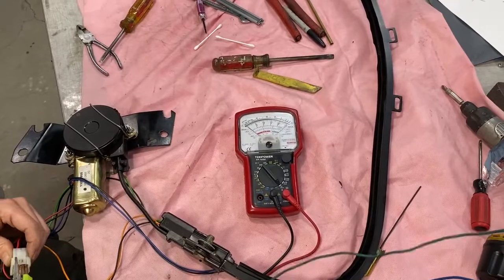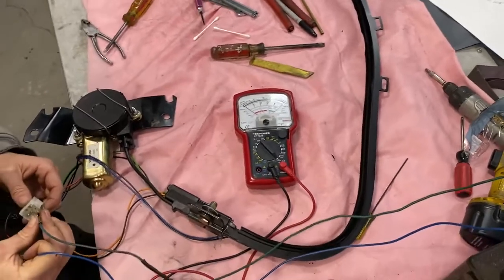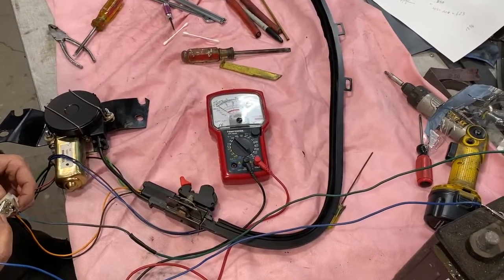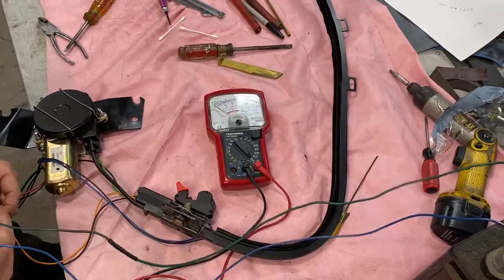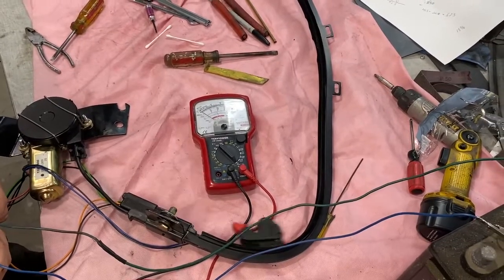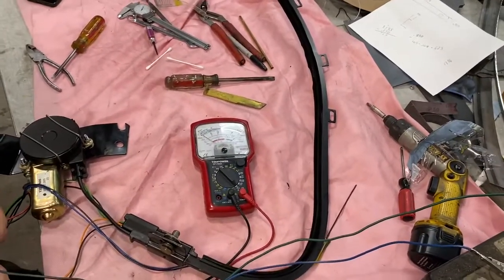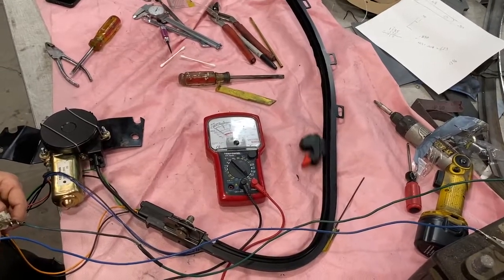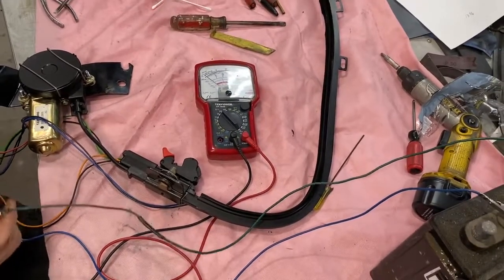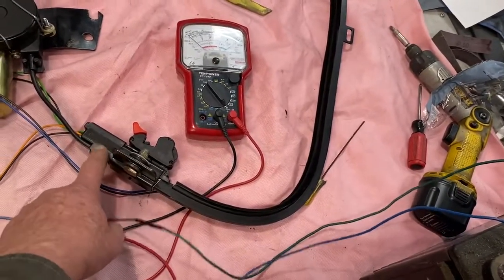Now we're going to bring the trolley back. We're going to switch the micro switches and reverse the polarity, which the polarity is reversed by the switch in the system — we don't have the switch here. And now it's engaged again. You can see that the tape and the electric motor here is properly driving the trolley in both directions as we reverse the continuity. You hear the deft click as it pulls in and operates the micro switch. So everything works now as a result of us reinforcing and making stronger the receiver on the end of the trolley.